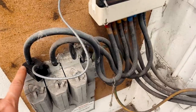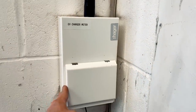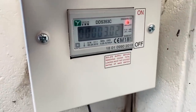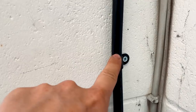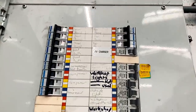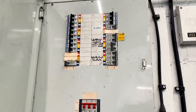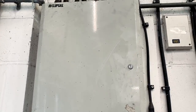This is the Zappi, all up and running, charging away at 7.5 kilowatts. Inside: we've got our wired CT coil going through the wall straight into the charger hardwired. We've got our energy meter here so the landlord can monitor energy usage — it's already used 3 kilowatts since we connected it up because he's currently charging. The armoured cable runs up with my new firefly clips — first time using those, very nice — up and over the top into the distribution board. We've got our new circuit all labelled up 'EV charger' on a new 40 amp type B circuit breaker, supplied by Uncle Phil.